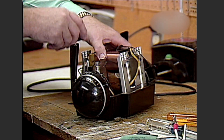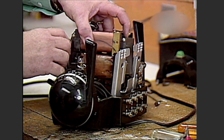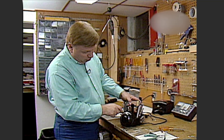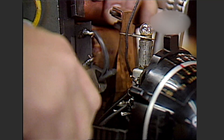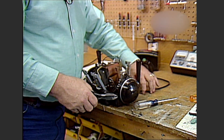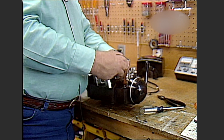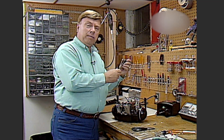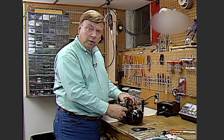Now we'll notice that the frame is loose on both sides. Let's turn the transformer, move the frames away, and pull the coil up. It's not going to come up very high. The purpose is to show you the power cord right here — the line cord solders on here and here and goes down through the hole and out the bottom of the transformer. We'll get our wire cutters, cut the old line cord out, cut the old plug off, and pull the line cord out of the transformer. We cut the plug off the old cord to make sure that nobody will inadvertently ever use it again.